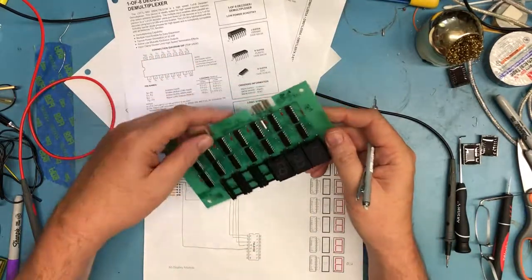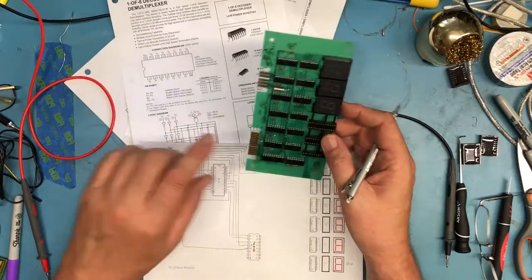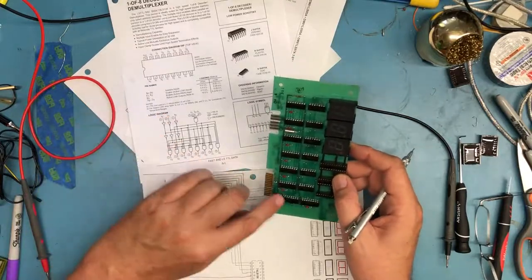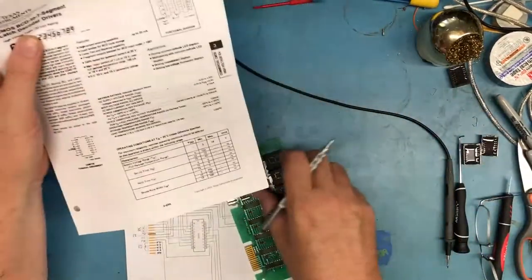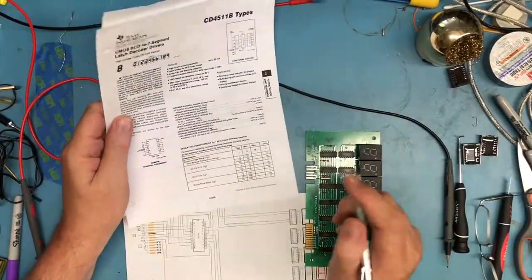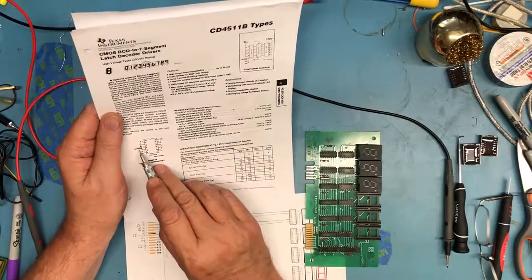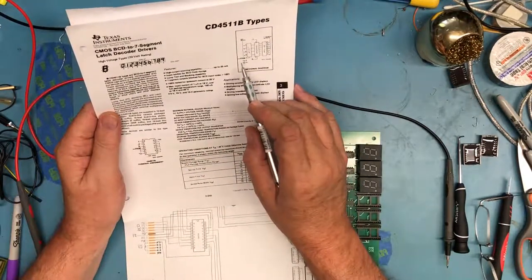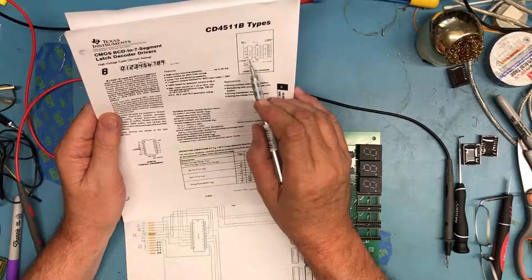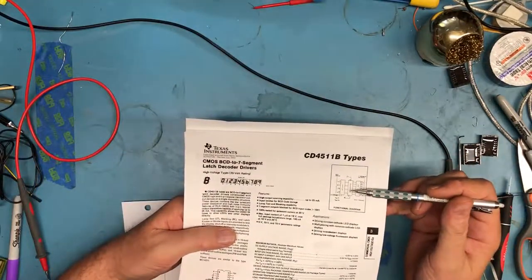So let's figure out now on the 138 which output pins go to which one of the 4511s. And what I'm going to look for, I'm going to guess, is the latch input. So there's an LE pin, LE slash strobe. I'm going to guess LE strobe is the pin that you actually pulse to latch. And the little block diagram here kind of confirms that to me.